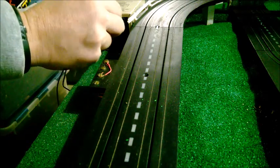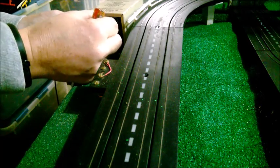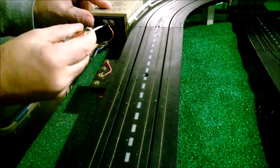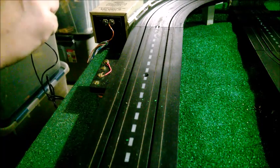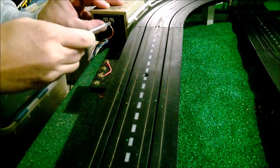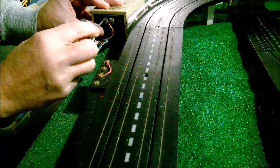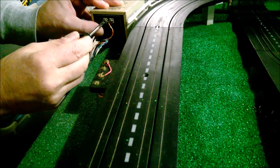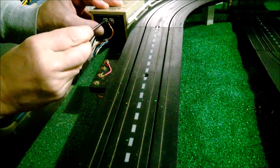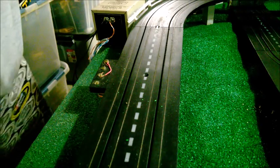What you're going to do is take the wire and put it around the screw. I need to connect over to the other side of the track for the other terminal, but for now let's get this wired. Wrap those wires around — make sure you wrap them good, because you don't want any shorts. Just run your screwdriver down through to make sure there's nothing touching, no bare wires that may have uncoiled.